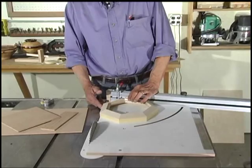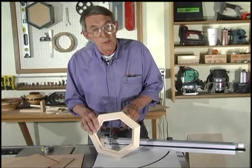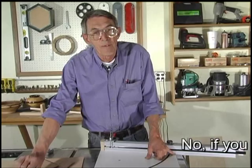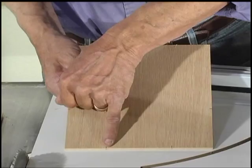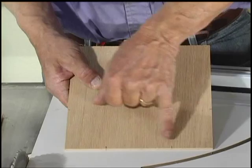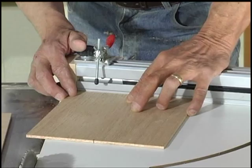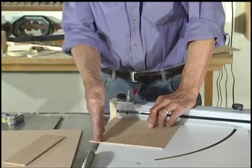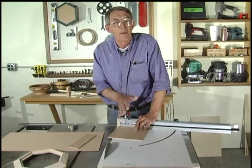What makes seven sides really neat is we cut seven pieces two times — 14 total cuts on this frame. The angle to do the seven-sided panel is the 14 line: 12.857142 degrees if you want to get picky about it. But all you have to remember is that for the panel, you set up on the 14. You always start with the side with the two marks — notice a mark here and a mark here — those go against the face of the backstop. You slide the material over and line your mark at the edge. As we make each cut, we rotate clockwise so that cut edge sits on the backstop. We can actually make a seven-sided panel in six cuts because we already have one side done.